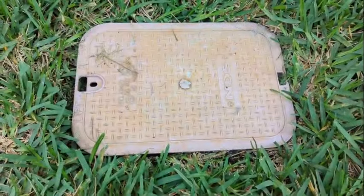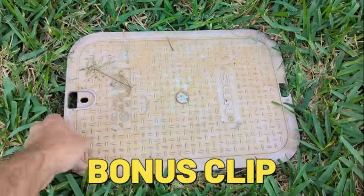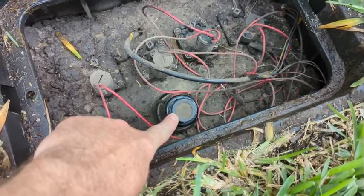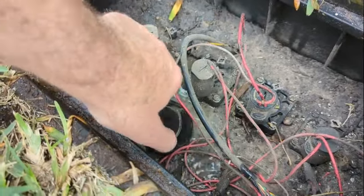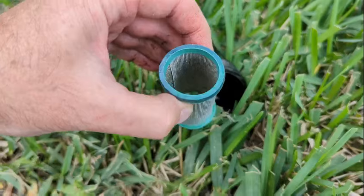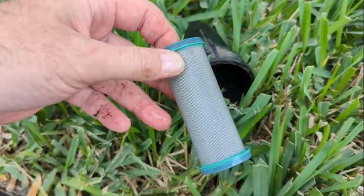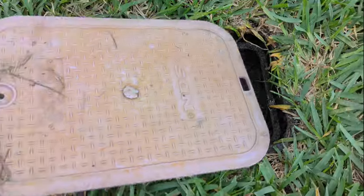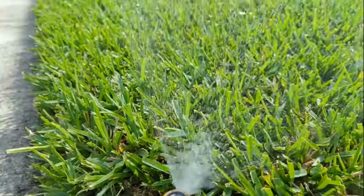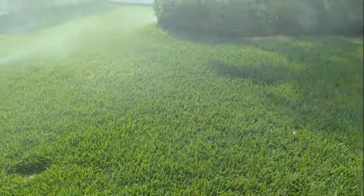Last, I want to show you this — there's a hidden filter in here. I believe it's for the entire system or it could be for the drip system for the plants. Either way, here it is under the cap — we unscrew the cap and remove the filter like this. This thing gets clogged up pretty fast so I check mine about once every other month. If it needs cleaning, an old toothbrush works well. Screw it back in and put the lid on. If you follow these easy steps, your lawn should get really good water coverage throughout the spring, summer, and fall. Thanks for watching.